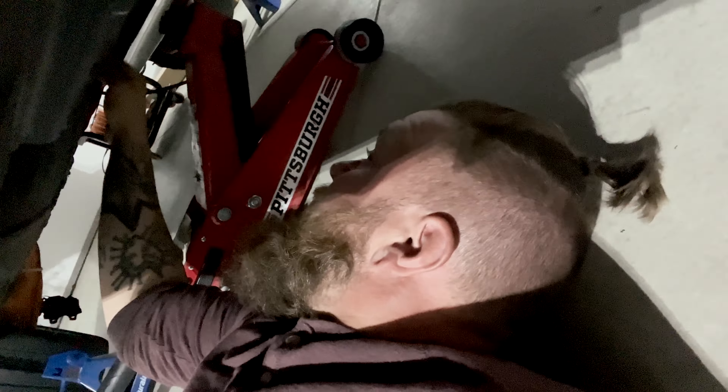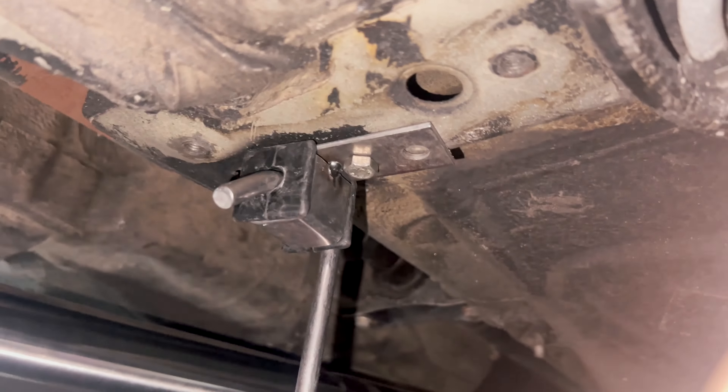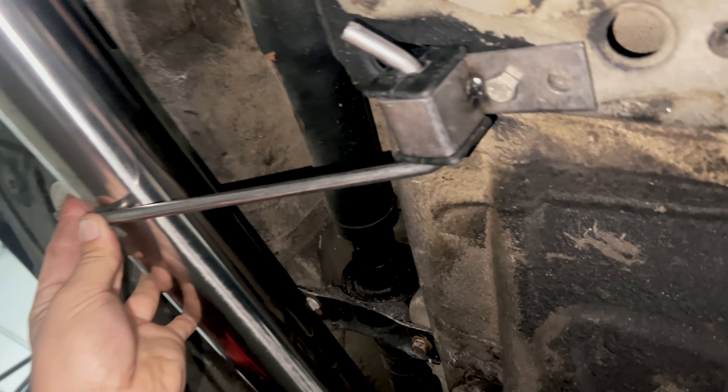I got all that sorted out. It's going down that way — gonna be a pretty straight exhaust, doing a couple 45s, and it'll be pretty great. Need to find some bolts. I'm gonna put on the hangers and put those in place, then take the whole exhaust off and weld it — that'll look a lot better than flux core. I got these hangers; they're just gonna get welded on there to lift it up a little bit.